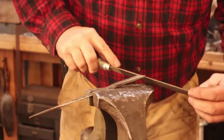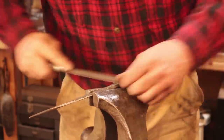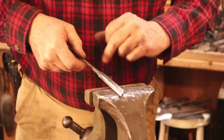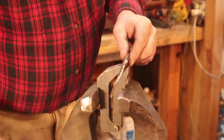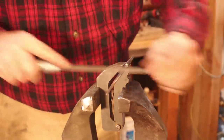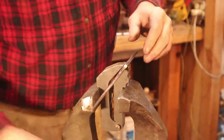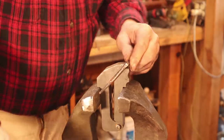Try to avoid rolling the file — you don't want to round that up. I've got most of the hammer marks out right here and that's going to need some fine finishing. It certainly doesn't hurt if you get that whole thing perfect though. I put an octagon shape on this and if you want to file that in to make it look better and crisper, the filing vise is great. And of course if you have a belt grinder that will make your life so much easier. You can do some of this with an angle grinder but it's kind of tough.